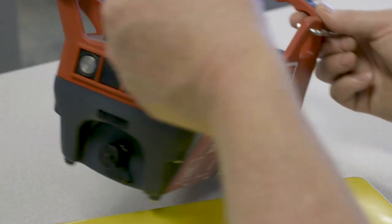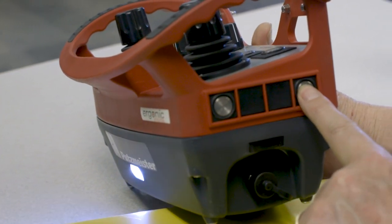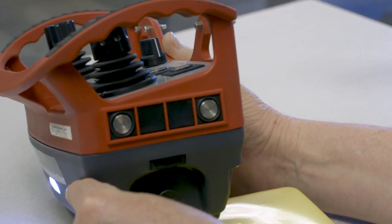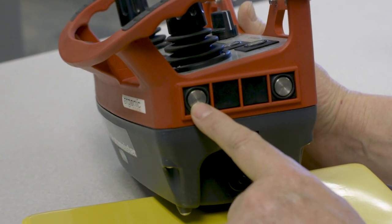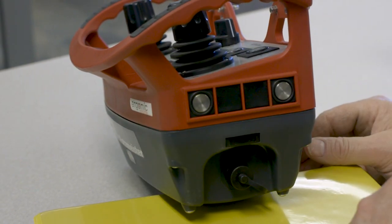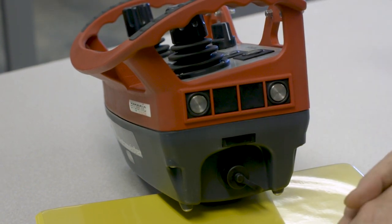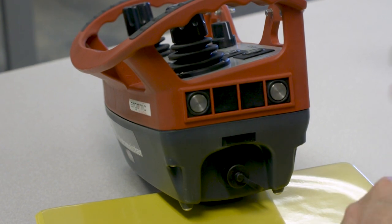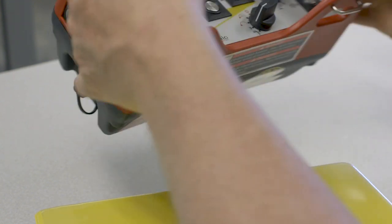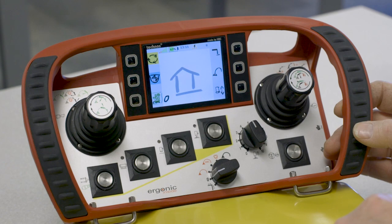On the end of the remote, we have two push buttons on the side. The push button on the right turns on an LED to help illuminate them on dark job sites. The button on the left activates the horn, and we can use the horn to signal mixer drivers. Whether we honk the horn from the remote or from the hopper, there is an audible alarm on the remote as well as a vibration — the remote has what's called haptic feedback. The remote actually shakes so you can feel it to alert the operator that somebody has honked the horn, even if they can't audibly hear it.